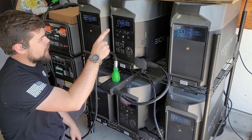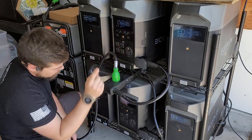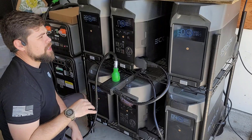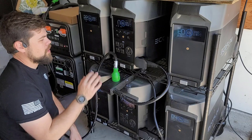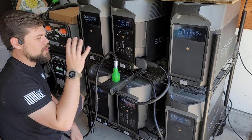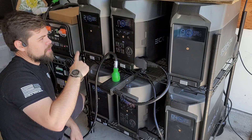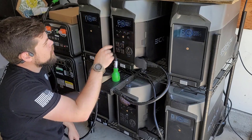I've got the electrical panel running off of this. I can see that leg A is using 530 watts right now, and leg B is only using 45 watts. That's what I experienced when I've tested this in the past — the top unit gets used a lot more. That's running the right side of the electrical panel, probably because on the right side I have a sub-panel which goes and runs the downstairs.